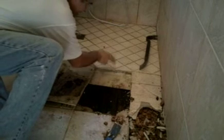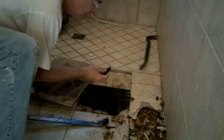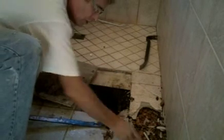Look what we have here. This is the shower pan lining, which only extends 6 inches past this floor. Well, water's going to come out here. Water gets into the grout lines, gets into the thin set and the Hardie backer, and weeps its way through here. And as you can see, this floor here is totally shot, even more so than the old deteriorated floor.